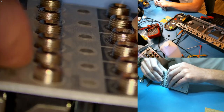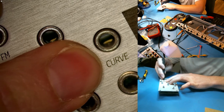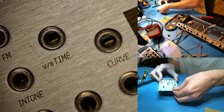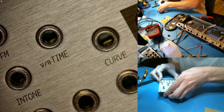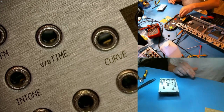You might have heard it — it kind of clicks down. You'll see they're basically flush with the top of the panel. You want to be careful because if you try to put the rest together prematurely, all the lights can come out again. So hold that down nice and tight, then move the rest of the panel so it sits down snug. You might have to push or pull the pot shafts a little bit to make it all fit, but it'll get there.